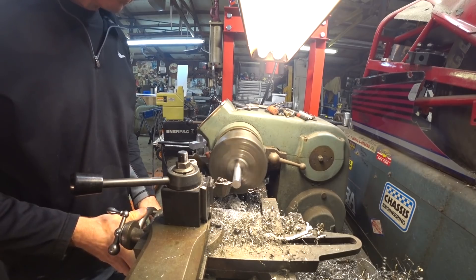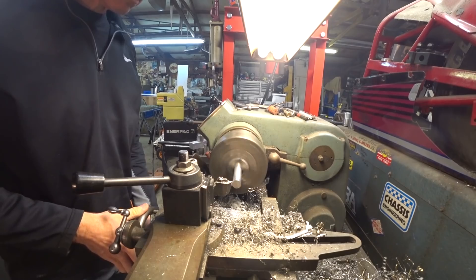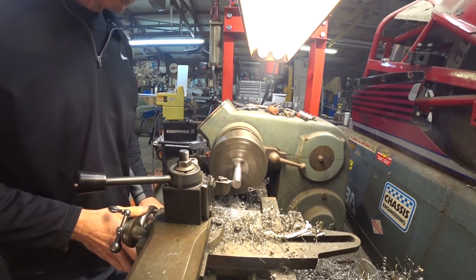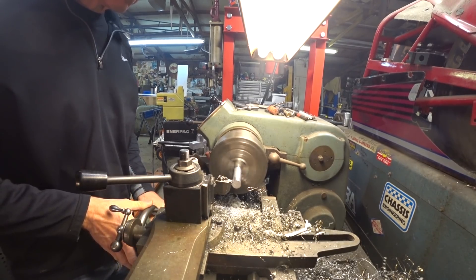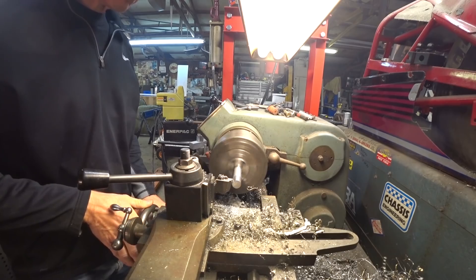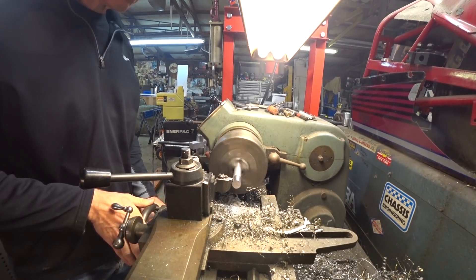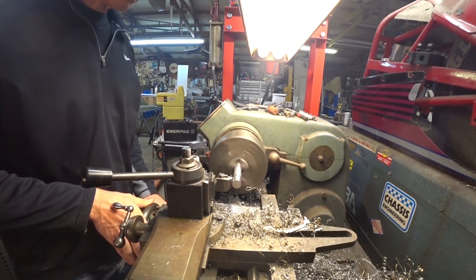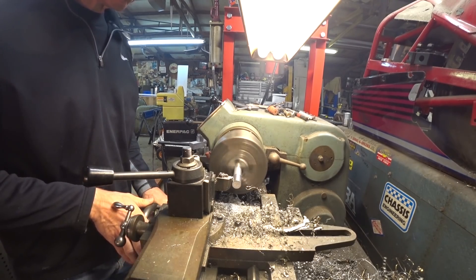My task here was to create a bunch of inserts for the rod ends for the aileron pushrods — the ones in the wings and also the ones in the cabin — so we could screw some rod ends into those and they can connect to the bell cranks. Here I'm on the lathe taking a bit of aluminum rod and just taking 10 thou off so it will fit into the ends of the 4130 rods that we have, because it was a little bit oversized to start with and you can't always buy the rods in exactly the diameter that you need.